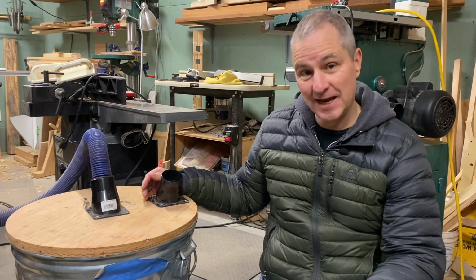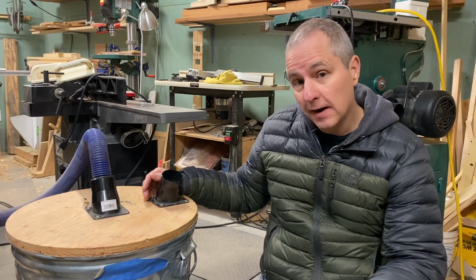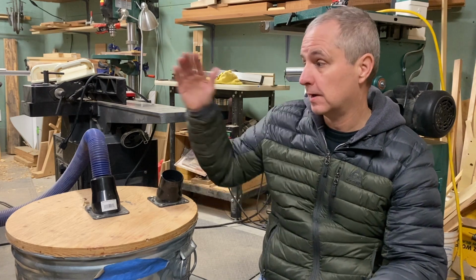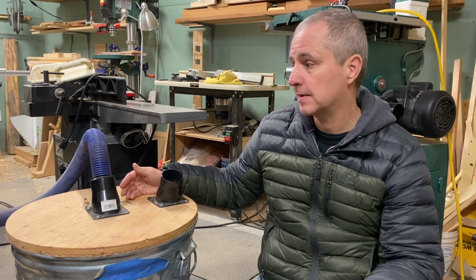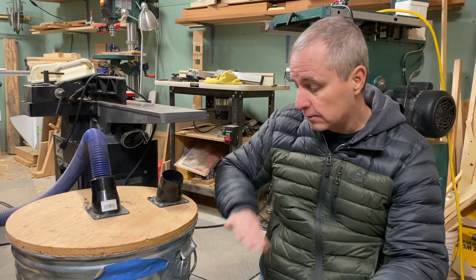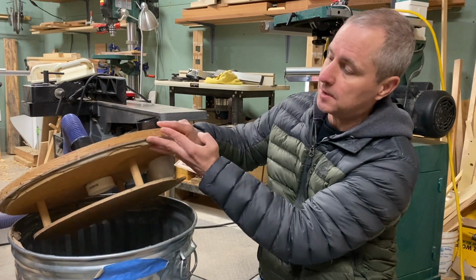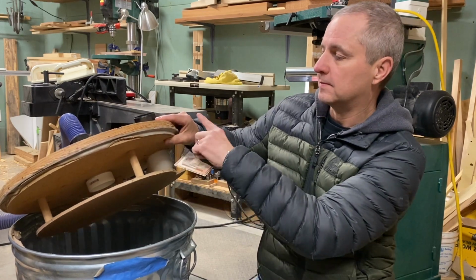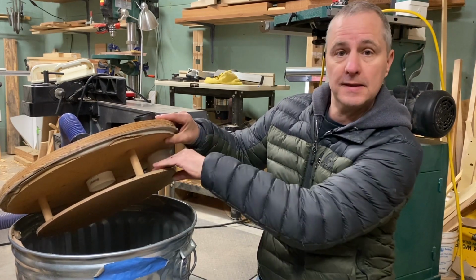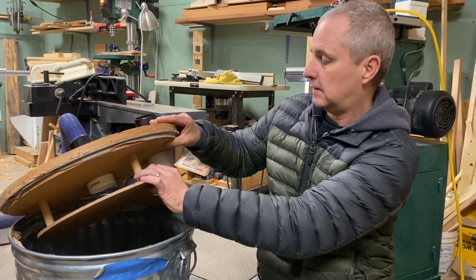This is the first stage of our dust collection system. It knocks out the bigger parts of the sawdust before the shop vac would be clogged by them. It's just made out of an old-fashioned garbage can and a couple of discs of plywood that form the seal at the top, and then a baffle that's put down from the top with a few dowels.